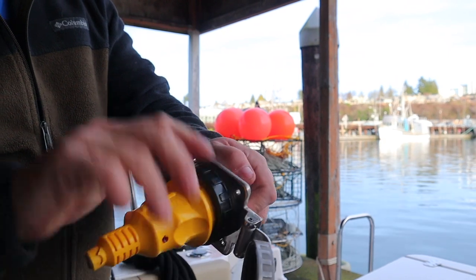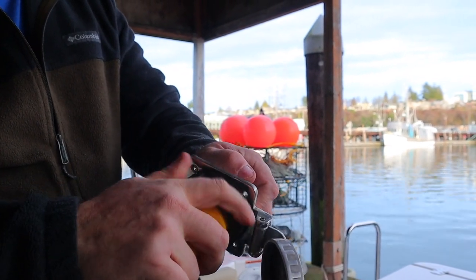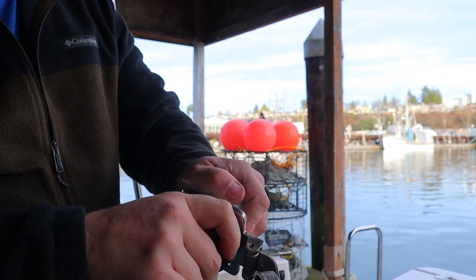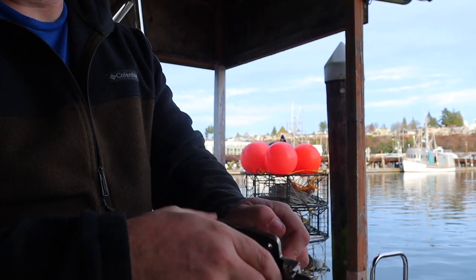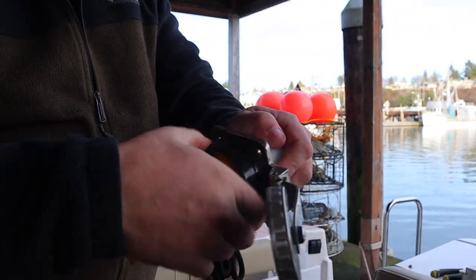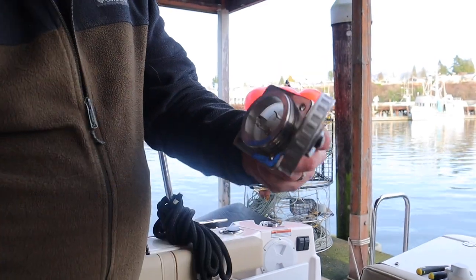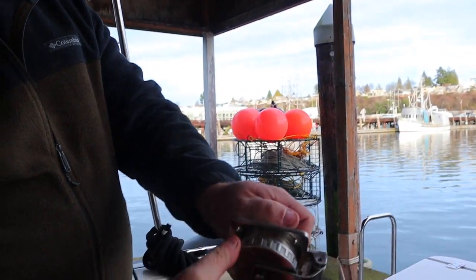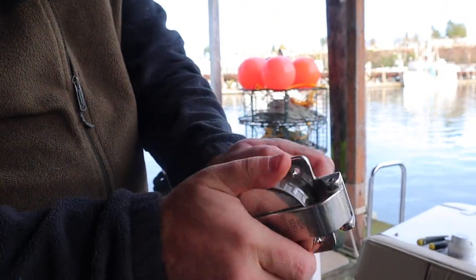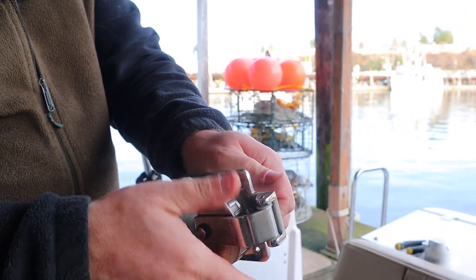And it only moves like a quarter of an inch, but it's got to be locked in place with the collar on tight. That's how you're supposed to do your shore power connections. That's really hard to do. And then when you untwist it, undo the collar, disconnect it here, then you got to take this guy, put him on here, and he always does this, and now he won't twist because he's cross-threaded, and you're like, oh, how's this work? And you have to sit there and fiddle with it.